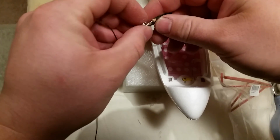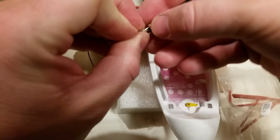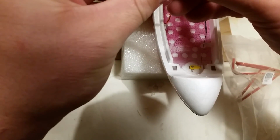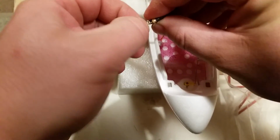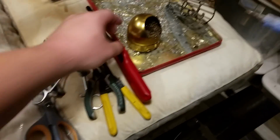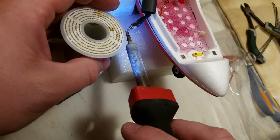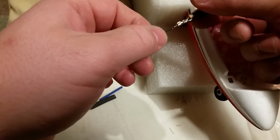And then once you get your little hook, of course these were twisted together before, just seconds ago. Now they're separating because I trimmed them the length without having them tinned together, which probably wouldn't have been a bad idea to get them tinned together first. Really shouldn't have to do that, but I guess it's life in the big city. You kind of got to do what you got to do, right? Clean the tip. Okay, make sure we have good solder connection. Yes, we do.